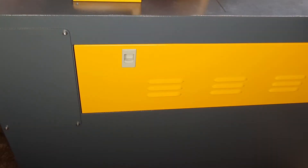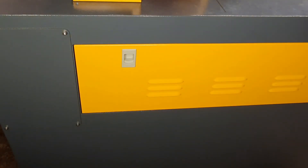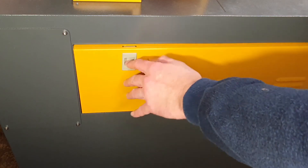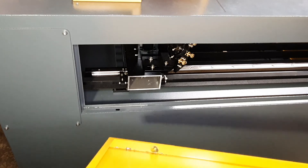The alignment process on this was pretty straightforward. There are lots of other videos about aligning your laser and I will be publishing my own guide fairly soon for this machine, so keep an eye on my YouTube channel. The side panels come off, which makes the alignment process a real breeze. You can unscrew the panel to access the first mirror, and the side panel comes off for access to the second mirror — you've got great access, with lots of adjustment points on both the mounting and the mirror assembly itself.